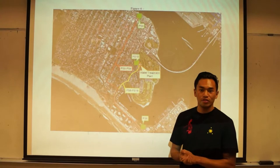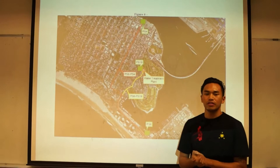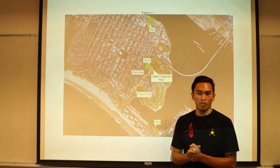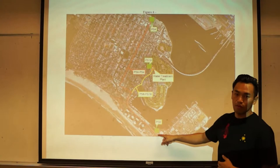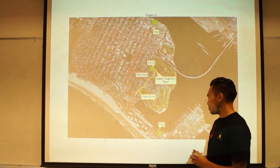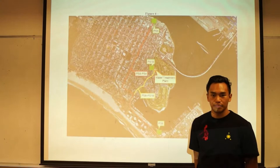The first part of our project that we need to figure out is how we're going to bring all of the sewage over to our site location to treat at the water treatment facility, which is located right here in orange. The entire city of Coronado Island has a very intricate sewer system made of both gravity-based pipes as well as sewer force mains. The location that we chose to collect all of our sewage from is PS8, which is Pump Station 8 on the city of Coronado. It is located in Glorieta Bay and this pump station collects all the sewage from the southern half of Coronado Island and Silver Strand. With all the sewage collected here, we have to first see if that location generated enough sewage to work for our water treatment facility.